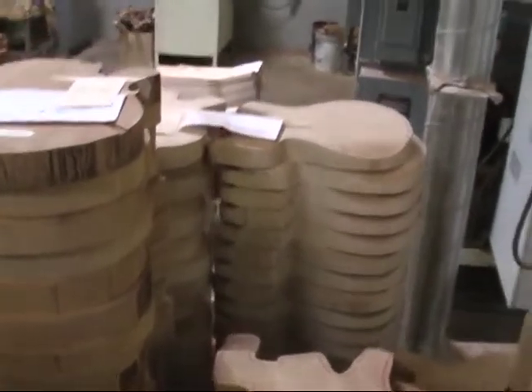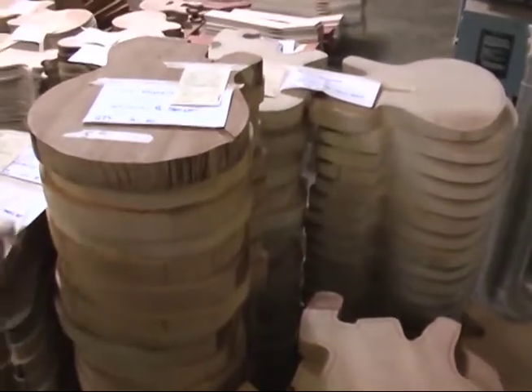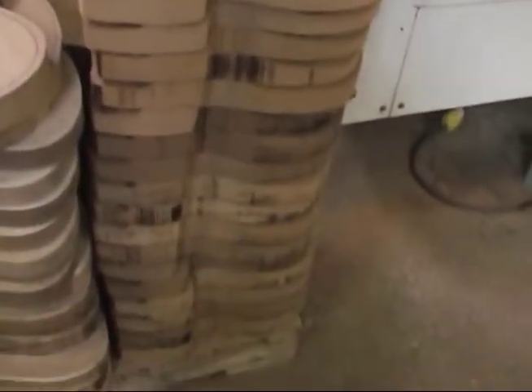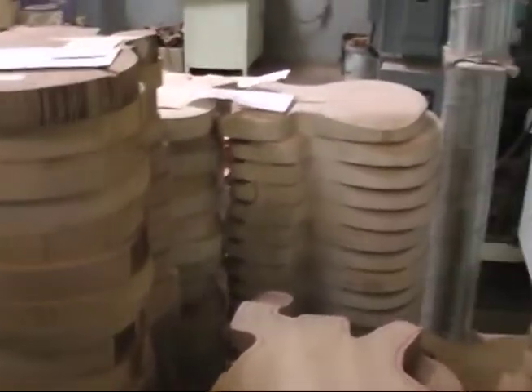Before we take you to the composite department, we wanted to show a few guitars that are works in progress. There are large stacks of guitars as we try to produce as many as we can per day while maintaining the quality and integrity of the Parker line. In the composite room, we use a composite material — a mix of carbon, glass, and glue — in a proprietary process to strengthen the overall guitar so it's less susceptible to temperature and humidity changes, assisting with tuning stability, intonation, and virtually eliminating seasonal truss rod adjustments.